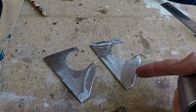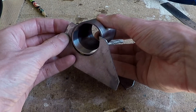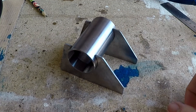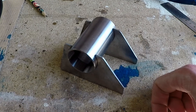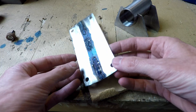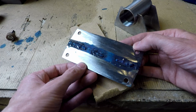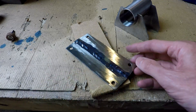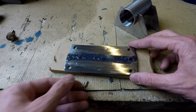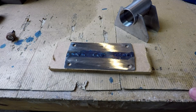So those are the two plates. I've just used the angle grinder to clear the paint off them. This is the bottom bracket shell, which is going to be welded into the plates like this. It's a British standard bottom bracket so there's a thread on either end, and I just need to make sure I get it the right way round because one is a left hand thread and the other is a right hand thread. I made the bottom bit out of two separate sheets because I didn't have a piece big enough. The welding's looking really ropey - I don't know whether that's because of my poor welding skills or the dubious quality of the metal. My head is telling me to stop and get some decent steel of known provenance, but my heart is telling me not to waste any more time and to crack on. And it will probably be good enough.